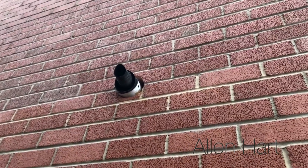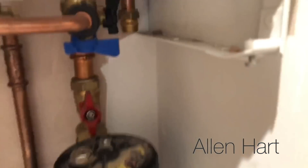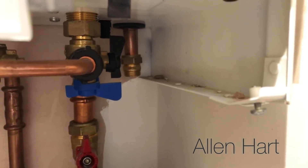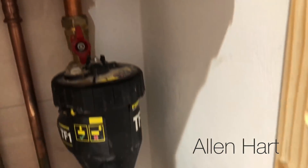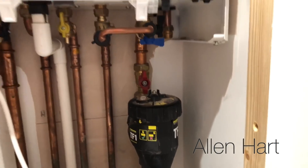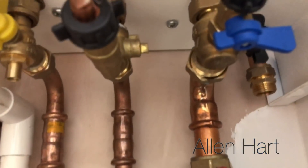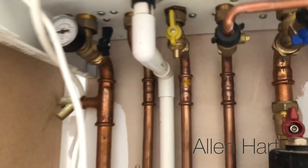The outside of the flue is not sealed either, and there's no PRV out here. The blow-off hasn't been connected back in, so if it over-pressurizes it'll just leak down onto the electrics. The handle's been snapped off on there too.